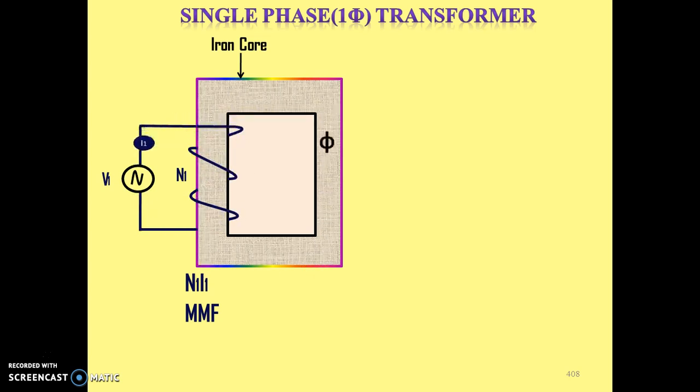This is alternating flux. Now this alternating flux is linking with the first winding — we can see the flux is passing through and cutting the first winding. So according to Faraday's law of electromagnetic induction, there is a rate of change of flux with respect to time happening in the first winding, and therefore an EMF will be induced in the first winding. Let it be E1. E1 is called the self-induced EMF in the first winding. So: AC supply voltage V1 causes AC current I1 in the first winding, producing alternating flux, which links with the first winding to give self-induced EMF E1.